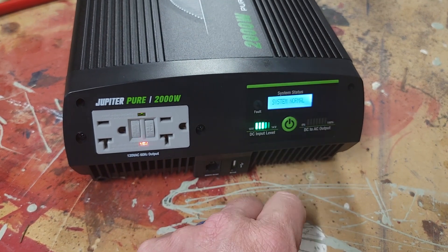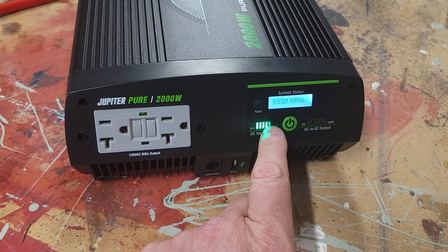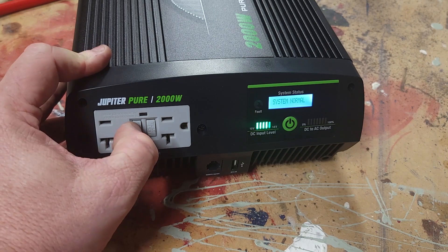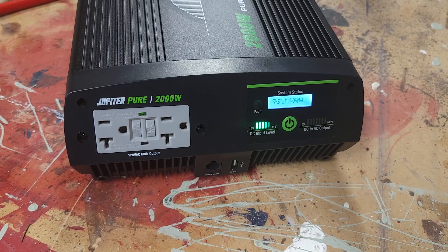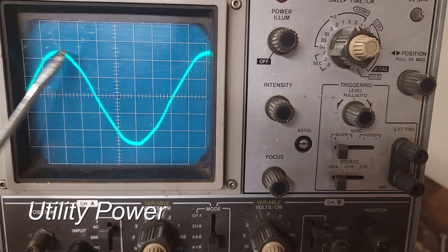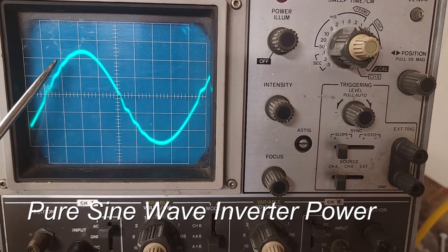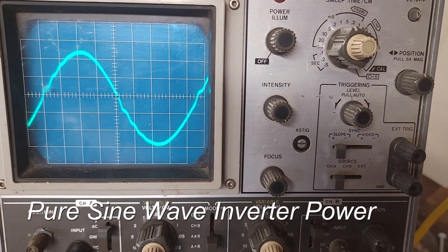I'm going to turn it on. We can see the voltage from the battery. Now I'll test the GFI protection. I want to hook it up to the oscilloscope to see if it looks like the sine wave you would get from utility power. This is how a sine wave looks coming out of utility power — notice it's a nice smooth curve. Here is the sine wave coming out of the inverter. It is a good curve at the top. There is something in it right here, but it's not perfect — it's pretty close.